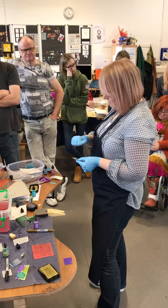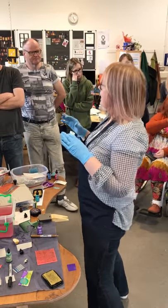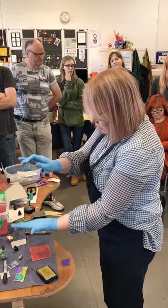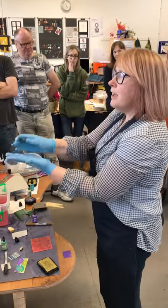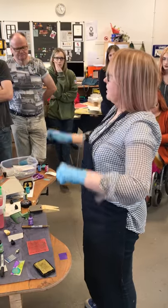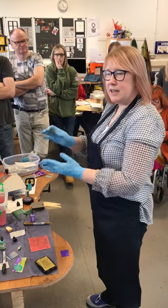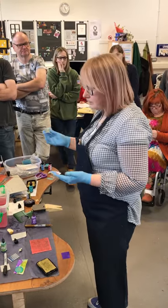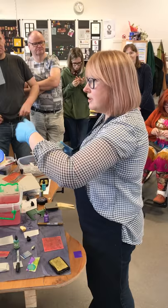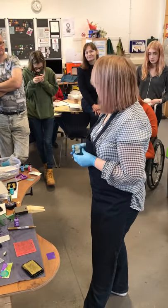Could you use an iron? Yes - just as you did with the baking paper and the iron. Another thing you could use is acetate, but it has to be photocopier ink. You get onto your acetate sheet, put the acetate onto the top of your aluminium, and we have a heat press - that would go in the heat press for about 30 seconds. That gives you your pattern or design straight onto there - then you can either leave it, dye it, or use acetone to take off the transferred ink and re-dye.